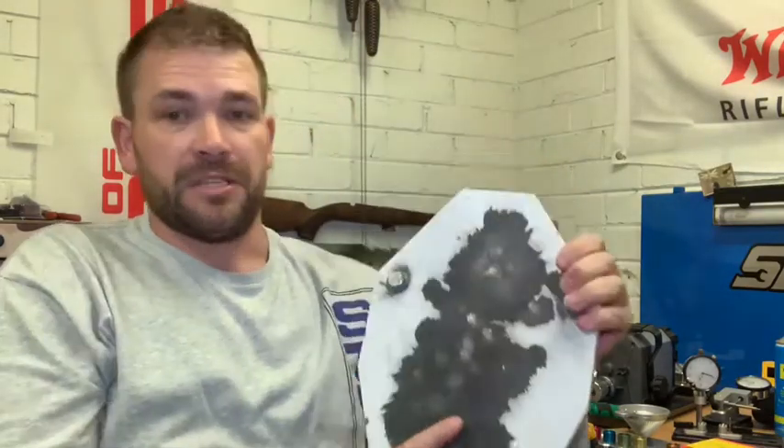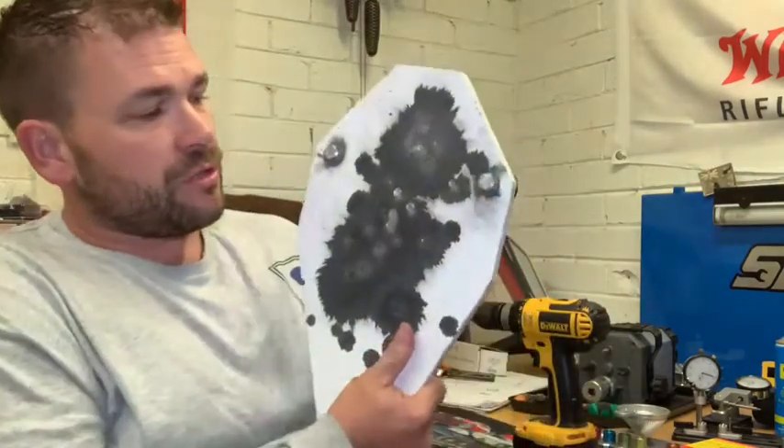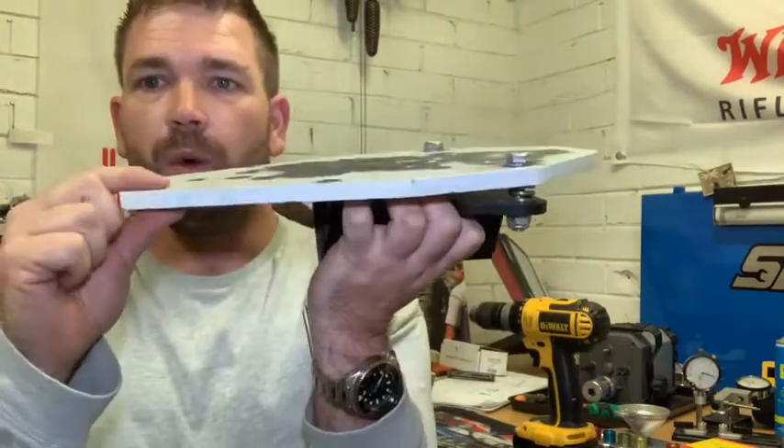A little more about the target itself: this is 500 Bisalloy steel. The very long story short is 500 Bisalloy steel is the best steel you can shoot with a centerfire rifle, bar none. We shot this with a whole heap of rifles — everything from 17 HMR, up to 30-06, 22-250, 300 Win Mag, and we even put some rounds onto it with a 338. The 22-250, because it's traveling so fast, three rounds on top of one another put the slightest little dent into the 12mm plate steel.